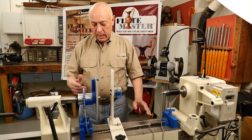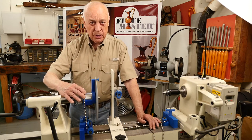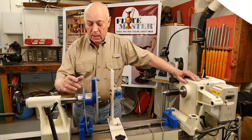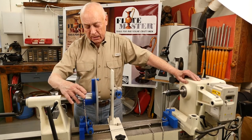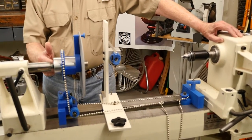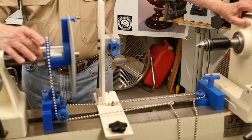We had to have absolutely no slippage, and this was a big hurdle to overcome. We solved that by using a sprocket with a ball chain that locks into the sprocket, so there's absolutely no slippage. On this end of the tool is a number two Morse taper, which is part of the tool, held in place by two bearings.